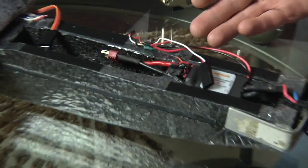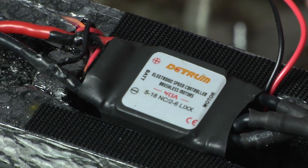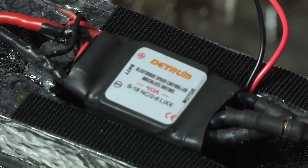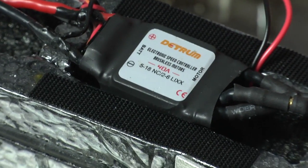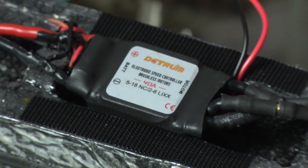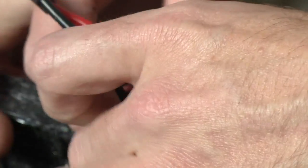So how do you get power to it? Simple — I wire it into the battery. In this case, I used a power filter. I like to run everything off of one battery in my systems. That way, there's only one battery to monitor. The problem is, the power going to the motor typically tends to be a little bit unclean, and therefore it needs to be cleaned up. The easiest way to do that is with a power filter.